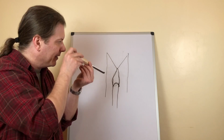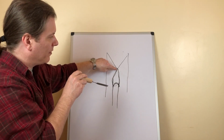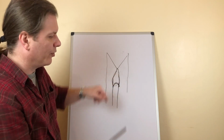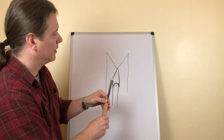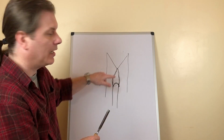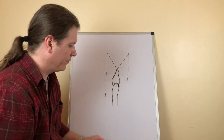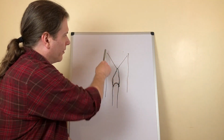So we're cutting in, and here there's not a lot of pressure. But once you cut the width of the base of the channel that this will cut, much further than that, you can see by here, by say 1/3 of the depth of what the wings will allow for, this is pushing its way out of whatever this cut. So there's increasing pressure the wider this gets. So even though this is similar, it's a reverse of the tool I've made here. We're still dealing with wings.